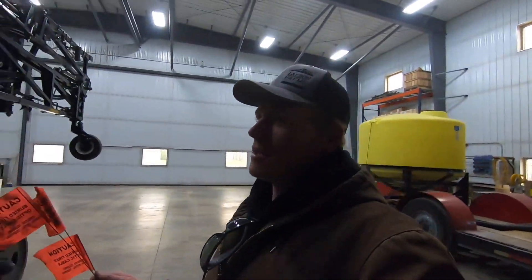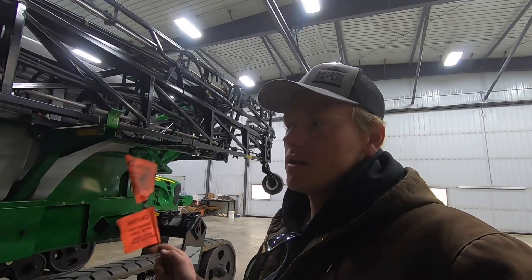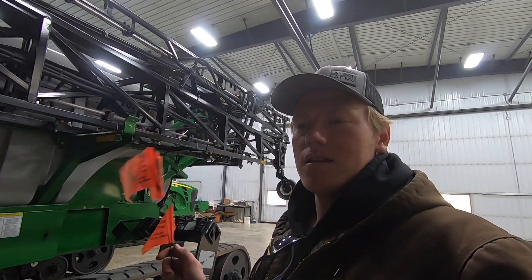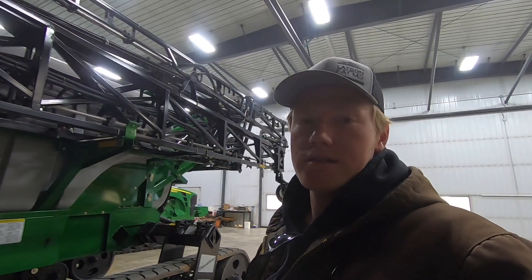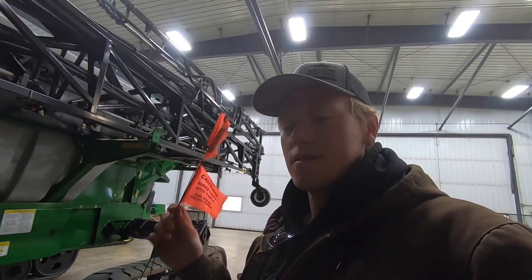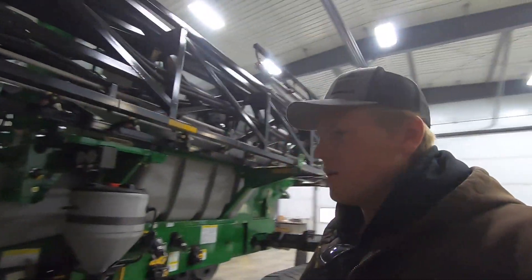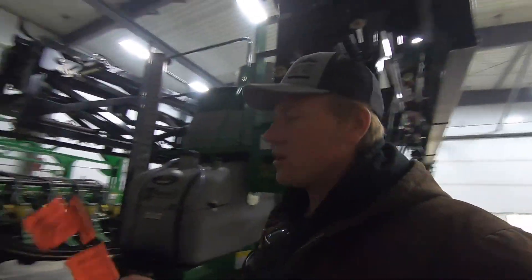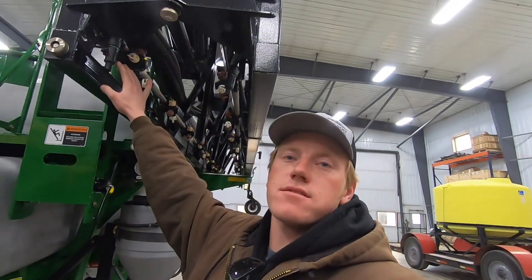While Doug and Chad are out spilling fertilizer all over the corn planter, I'm going to test fire the sprayer out in the field. I got the offsets put into the 2630 and we're going to go out and spray a mock headland and then test my shut off and turn on times so that I'm getting good coverage and not having any skips later in the season. I just got water in the sprayer, gonna go outside and do that. We'll flag where my headland is and you guys are going to help me see if we're getting good coverage. Also gonna have to get the steerable hitch set up - pretty simple, but I got to get out and unfold and drive and make sure that these sprayer tracks are following my tractor tracks.